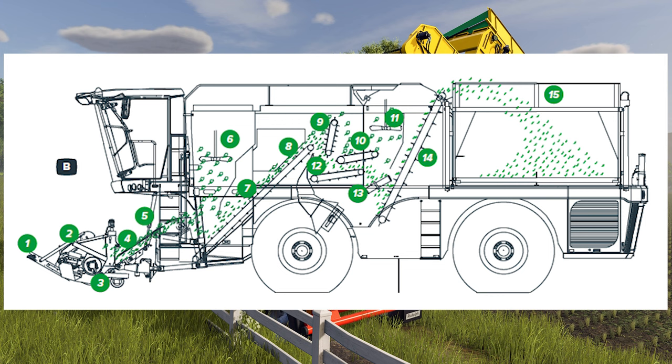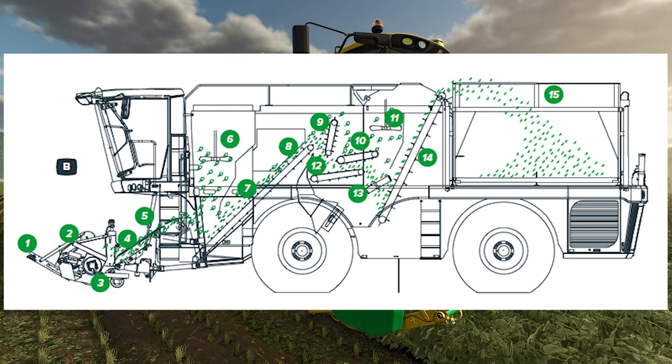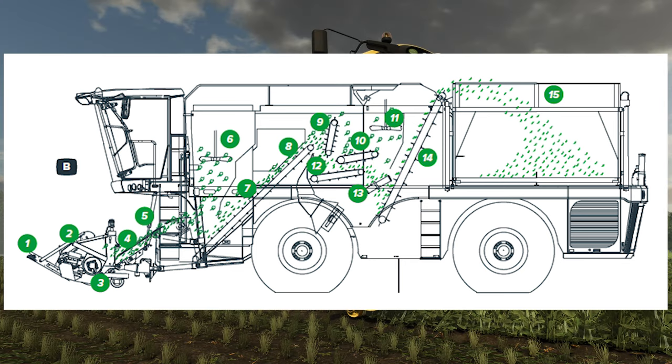The picking height control floats the header on the ground to assure a nice and even harvesting height of the plant. Once the plant has been cut, it is transported back into the main body of the harvester via the first incline conveyor, numbered four on this diagram. Stage five introduces an optional component to aid in the removal of plant vine and seed pod. The BP 2140E uses suction to then lift away the lighter materials like vines and leaves, allowing the heavier seed pod to fall onto the second incline conveyor, listed here as step seven.